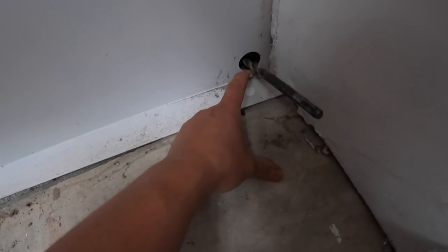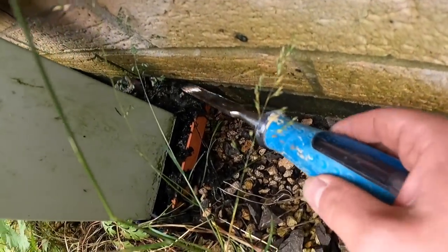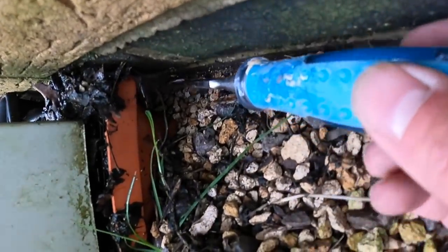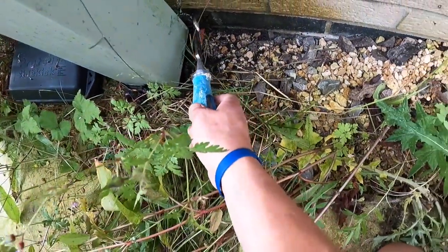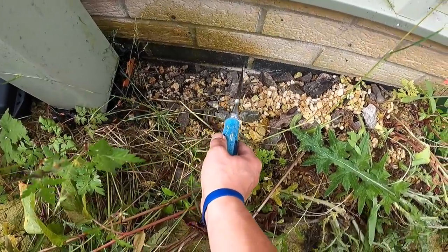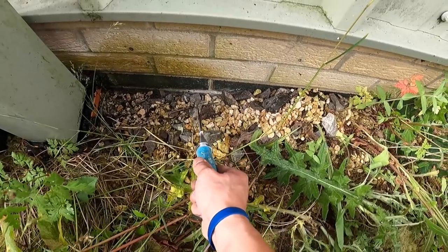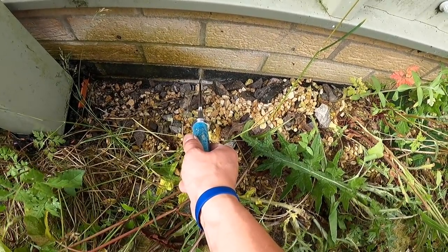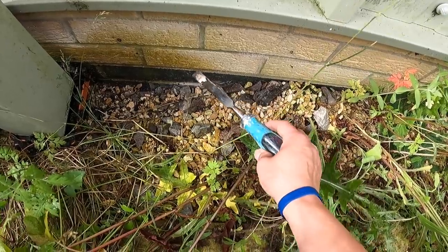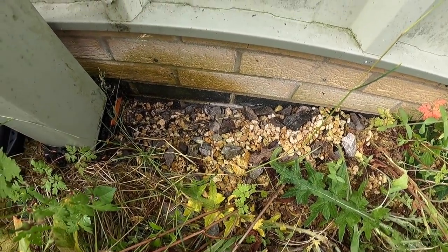Well, I've drilled my hole out down on the angle. I'm going to go and find it now outside. Right, so that hole is no good. It's down there. There's my drill bit behind this downpipe. So we're going to have to probably come a foot in, because I want to come about here on the brick core. So I'll come a foot further in, drill another hole in the metal, drill it out, and then we'll have to just run it. I could actually drill on the, no, it's a bit too hard. Then we'll have to just cleat it on that metal around and in.